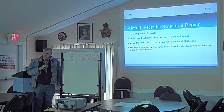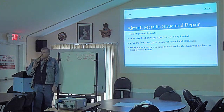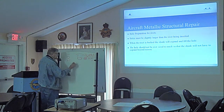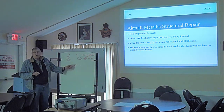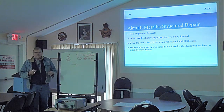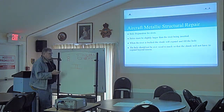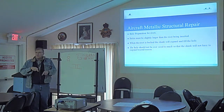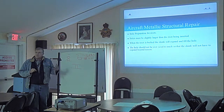Every hole that we drill, no matter what, we start off with a number forty drill bit. The reason we do that is — say we have a piece of sheet metal, we put a little center punch mark in it, we drill that hole, and we realize it's not quite exactly where we want it. We can do what we call drag the hole — we can move it a little bit. There's our number forty hole. If I'm going to upsize this to five-thirty-seconds or three-sixteenths and I need to move the hole this way, I can just move my drill bit over, angle it slightly to get it to start, bring it straight, and run it in and out. It's one of those tricks you learn in the trade.